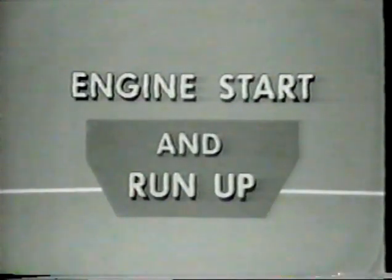Now we are ready for engine start and run-up. Let us review some precautionary measures, limitations, and procedures prior to starting. Also keep in mind the maximum wind limitations for starting and stopping the OH-58A Kiowa is 45 knots.